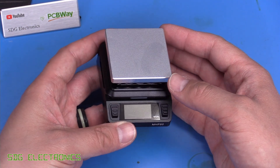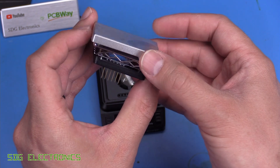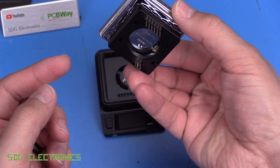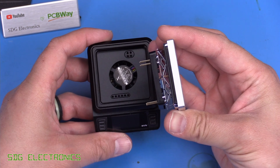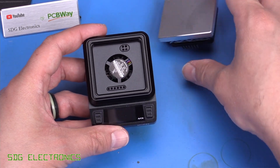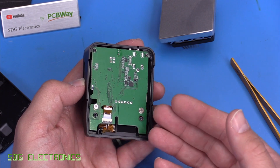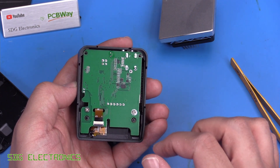Let's take a look at the construction of the device. Just like the MHP30, the top is unpluggable and you can swap it out for different versions or a replacement if the heater burns out. The heater appears to simply be a resistor — we can see the two wires going into the top part, along with the thermocouple wire, using 0.1 inch headers that just plug into the bottom of the unit. There's the fan, which I think is for cooling, but you can't really hear it running — it's very quiet and there's not much airflow even when the menu says it's spinning.